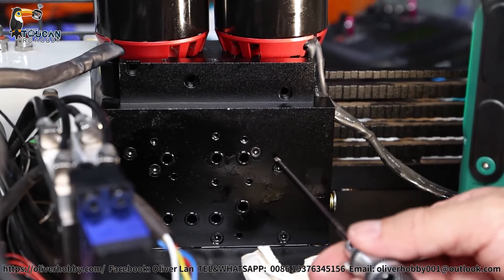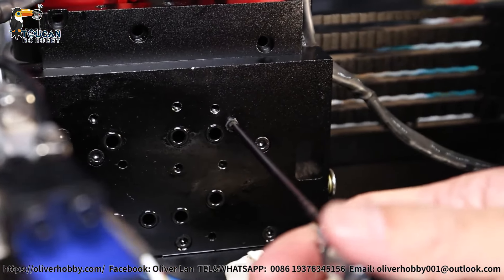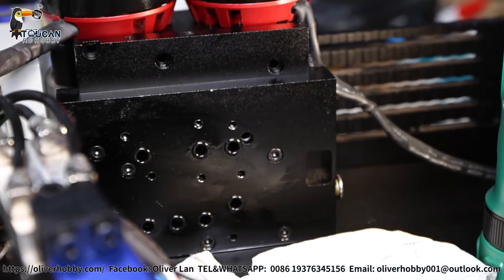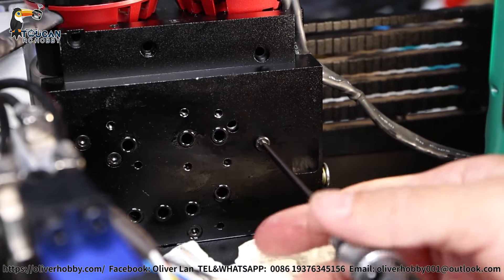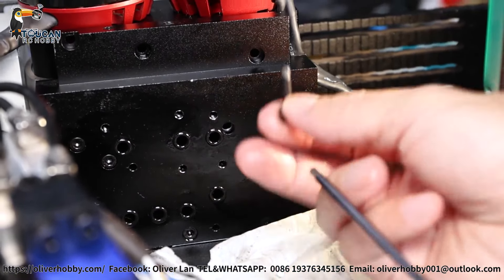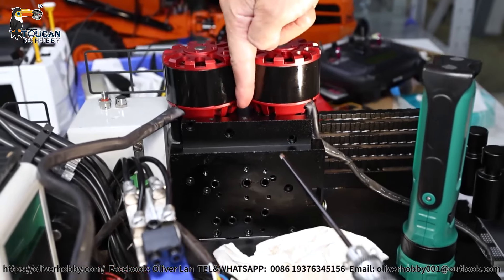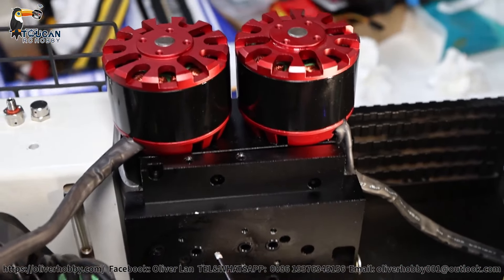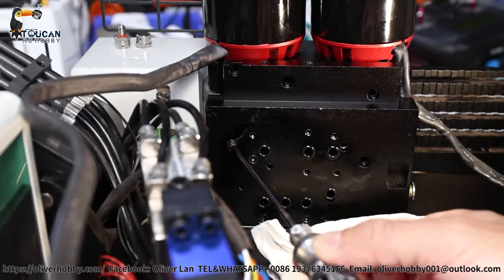All the valve blocks are now removed. Between the valve blocks, in between the two channels — in and out, the main channel — you have all your seals here. When assembling, please check they are in position. Also here, there are oil seals to the middle black connection part — one here, one pushed inside this middle connection part, so two oil seals in between.